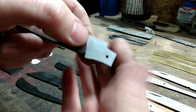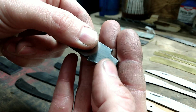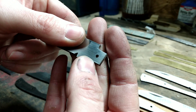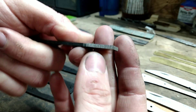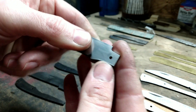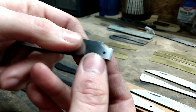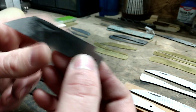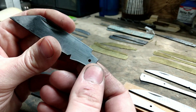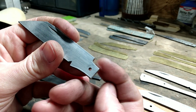Nothing complicated — I have to keep it simple. On this one here, as you can see I've already ground down and of course everything's still pretty proud. That was on a 36 grit belt so that's pretty rough. Still yet — yeah, you can see that's still real rough. As I work it in I'm going to be using a 120 grit to begin with to get close, and then when I start getting close I will move up to a 400 grit belt. But the first thing I'm going to need to work on is the open position.